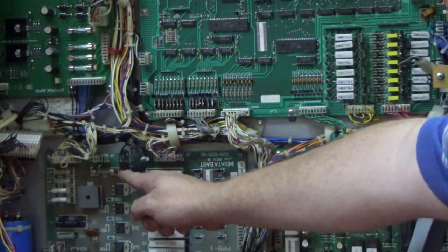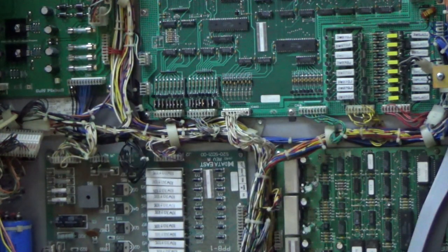These transistors are running 50-volt coils. So that coil in particular is a 50-volt coil. Now you might say, how do you know all this? Because I looked in the freaking manual, that's how. I've worked on all this stuff before, but it's hard to remember all of this crap, right? But if you look in the manual, you go, oh yeah, I remember how that works.